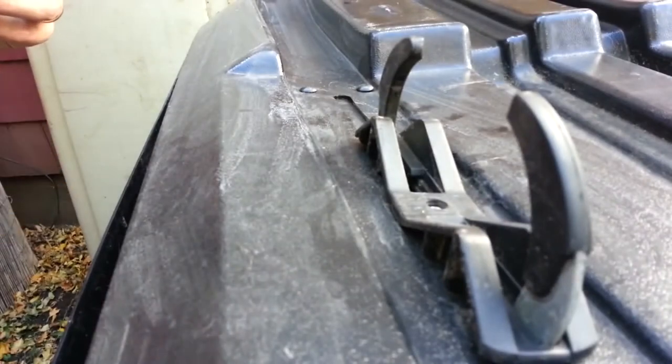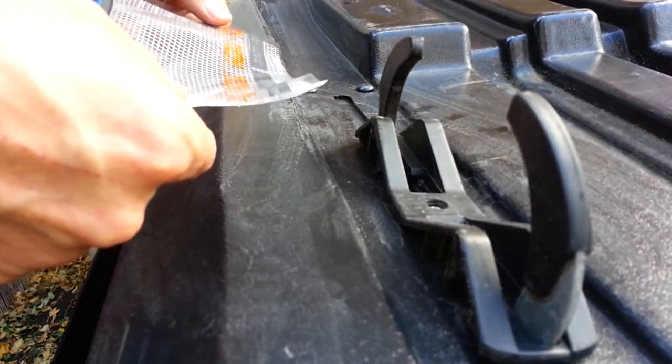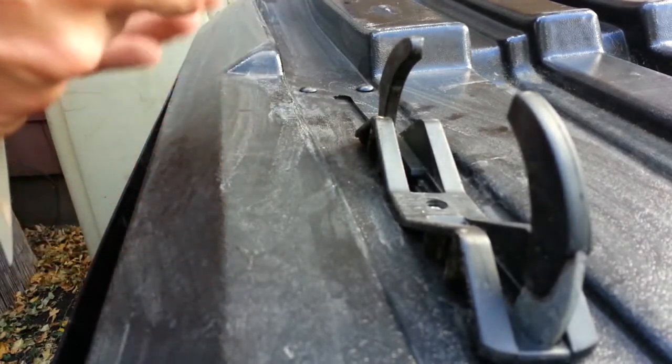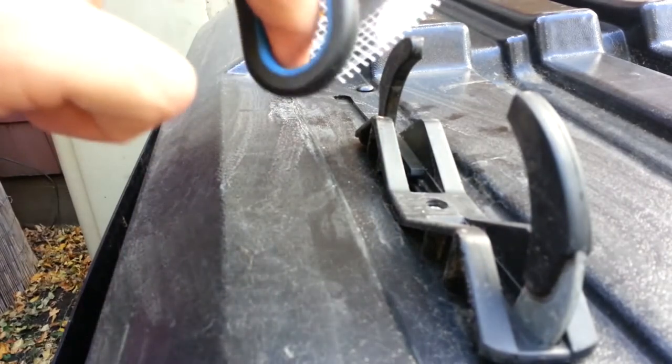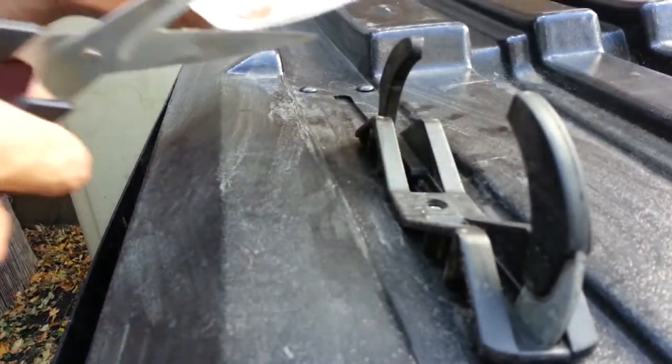Here's the other crack I've been looking at. I'm going to lay out the fiberglass tape, get a measurement on it, and then cut it with scissors. Note that it has a little bit of a plastic coating on it — you'll want to make sure that you pull that off before applying.